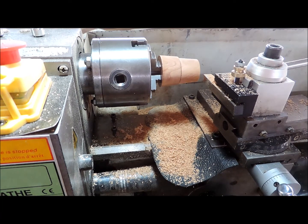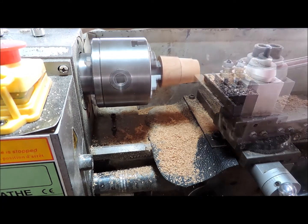I did the four knobs, the little hubs. I did it the wrong size, so we now have to have a 7/8 major end and a 3/4 minor end. So a 7/8 major, that's 850. 0.85, is it? 875, I should say. 0.875.